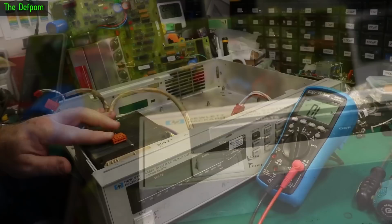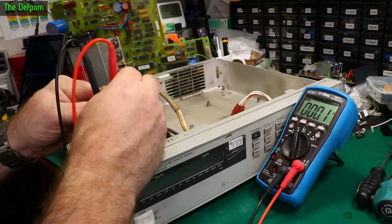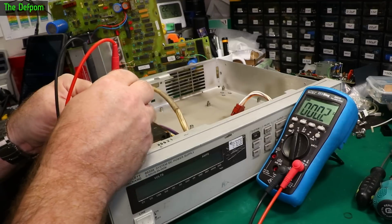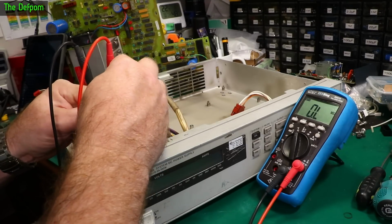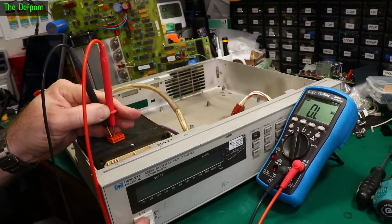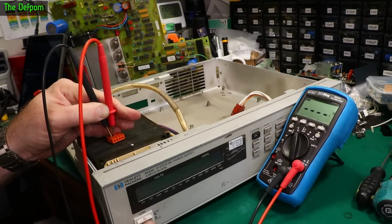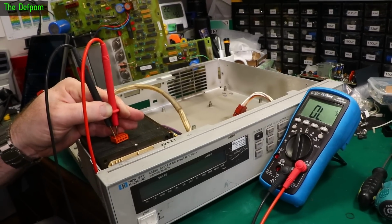It feels like it works. Let's test it, see how it actually works. So look at that. If I put the contacts there, lead resistance is basically 0. So with the wires and the switch, that's looking good on that side. Cycle it a few times. Oh, have I lost connection? Oh look, that one didn't go that time. And again. Is that side not actually toggling over, maybe? Sometimes it isn't actually working, even though I've done all that work to it.